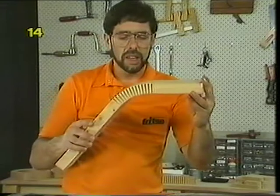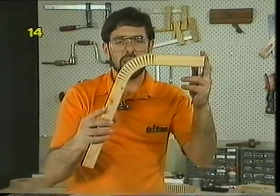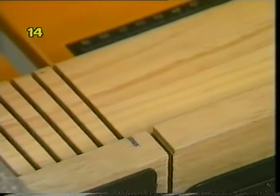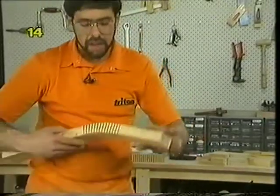After stopping at 14 cuts it's clearly not enough — that's not a right angle. Add another couple of cuts. Put it back in, line up the last cut you just made with the pencil mark, and then make the next cut. Just keep lining up the cut you just made with the pencil mark, and that gives you perfectly even spacing.